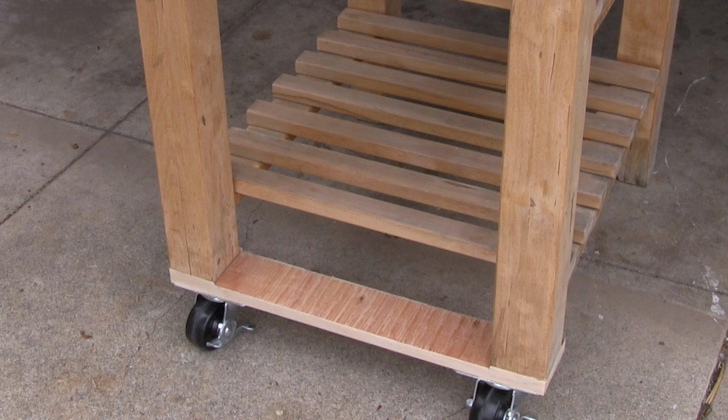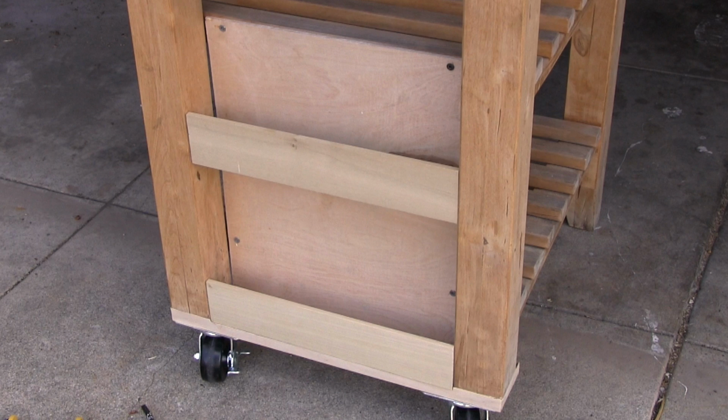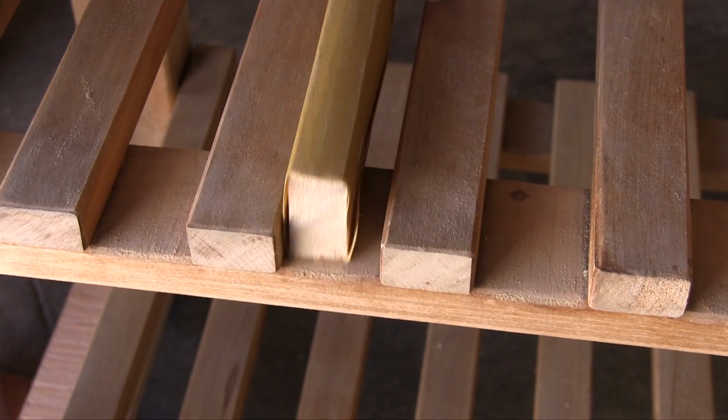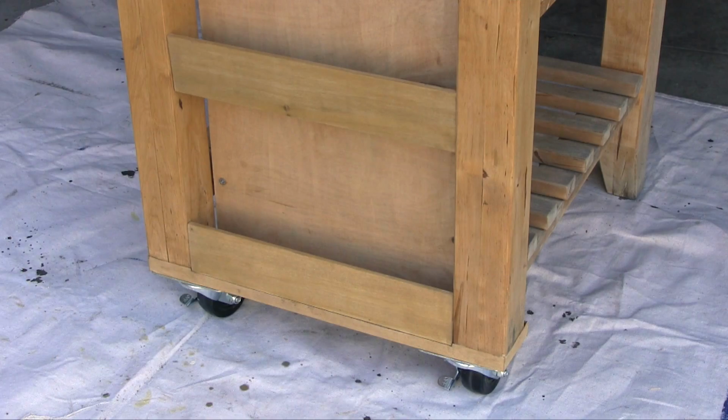When I was looking at my MacGyver fix, it gave me the idea to use the side of the cart for a spice rack. So I used some wood that I had on hand to make it, but that ended up making it look like a bit of a Frankenstein. So I made sanding blocks by stapling sandpaper to scrap pieces of wood, and I sanded the entire cart, stained it, and that made all the different types of wood blend in nicely together, while still keeping the rustic look.